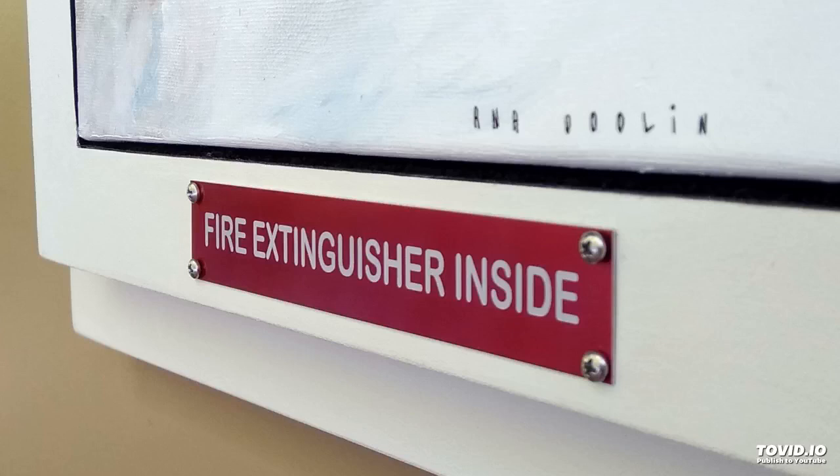We'll first look at the inside of a typical interior wall. Now, some walls contain the short horizontal 2x4s you're looking at, called blocking or fire blocks, which keep the wall studs from curling to one side or the other during construction, and also help keep a fire from spreading through a house by cutting off its oxygen supply.